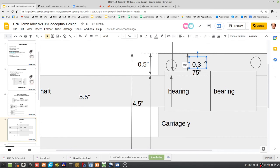And we need to consider a quarter inch. So 0.25, that around there is also 0.125, 1/8 of an inch. That's marginal, but that's doable. We put it right up to the bearing and still have just a little bit of meat on the other side.